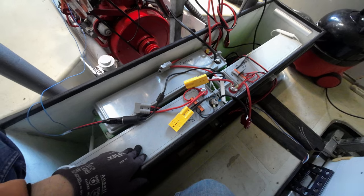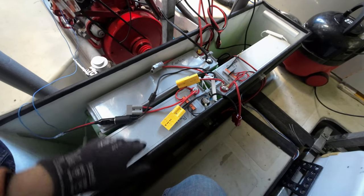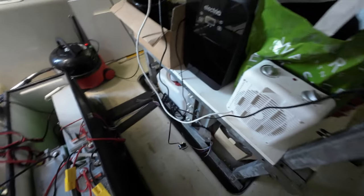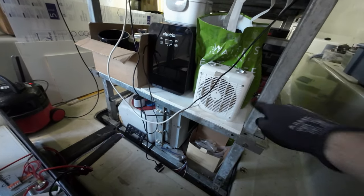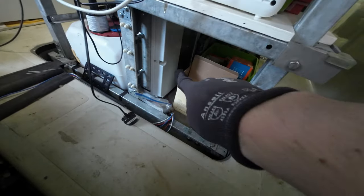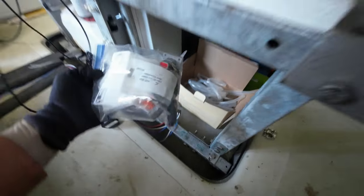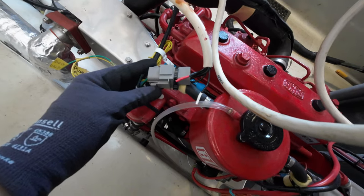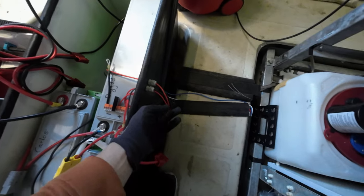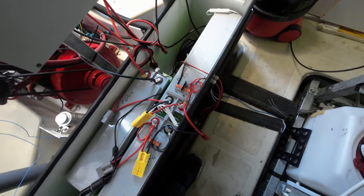The main battery bank down here is going to be four batteries — currently there are three — at 24 volts, two sets in parallel. Over here is where my heater and little fridge are at the moment; that's just going to end up being storage later on. The solar charging shack is down there — I'm swapping out these Anderson connectors, which I'm not very happy with, for more Deutsch connectors. Those of you who introduced me to Deutsch connectors will be delighted because I really like them and I'm starting to put them in all sorts of places.